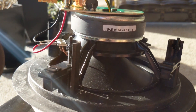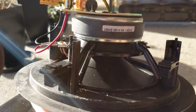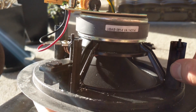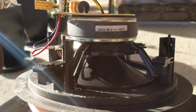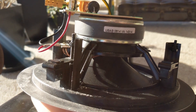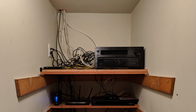So really easy to do this kind of stuff. The hardest part is the wiring — not hooking up the wires, but running them and hiding them. It costs a lot of money if you go to a high-end audio-video store, and it is really not worth paying somebody to do this if you have a little bit of time. In my case you have to get messy and go up in the attic; if you are lucky you may have a basement. If you are doing it from scratch it is definitely worth running it yourself. In my case it runs over the top and down into my electronics closet, where there is a speaker connection that I just plug right into the receiver.